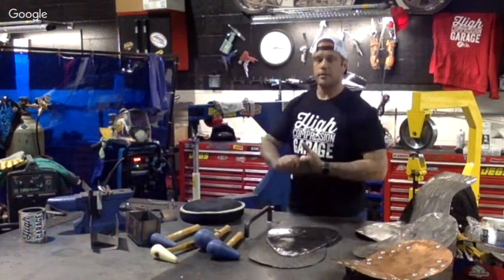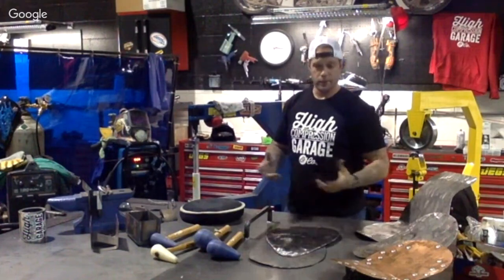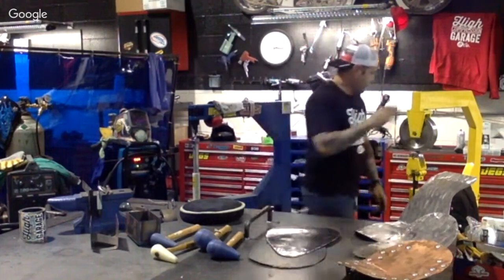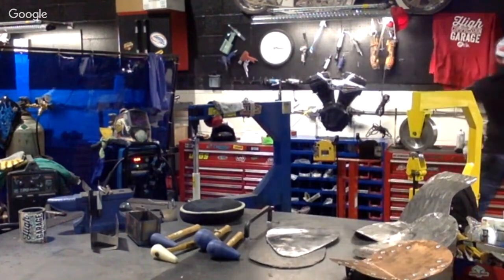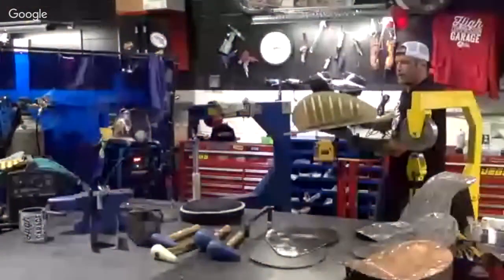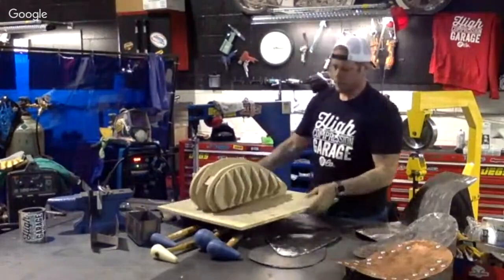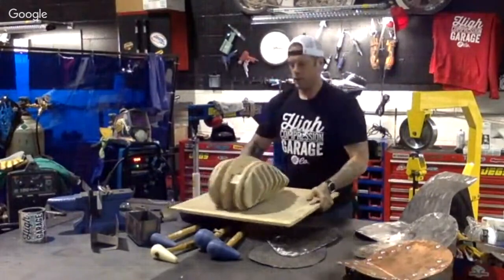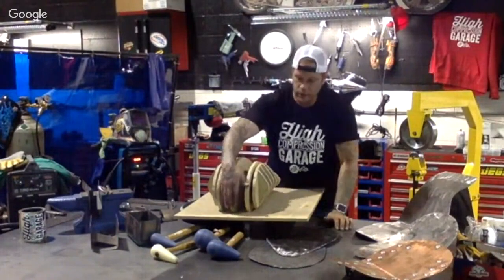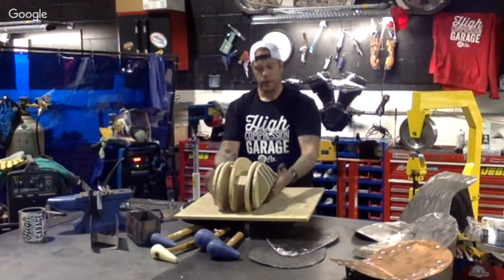So that battery box, and later on getting to that daredevil stuff of building tanks and things, where you'll need bucks, and a buck is pretty much a template for gas tanks. Which, real quick, this is a buck we built for one of our tanks. And what we did with this is actually, this is more for a bobberish style. But we've taken wood and cut the radiuses that we want for the top right here, and to have it step down, go into here to the sides.